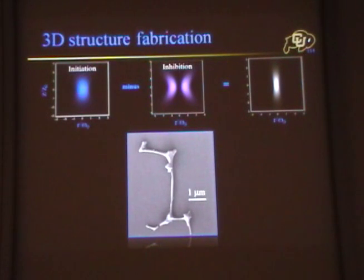So this is some preliminary results, you can tell they're a little preliminary because that's ugly, of doing now full three-dimensional stereolithography, like the two-photon folks do, with this, to prove that this is a transient feature. What we're drawing here is 100 nanometer diameter, 5 micron tall wires. 5 micron seems short to the graduate student until we realize that 5 micron and 100 nanometers is an aspect ratio of 50 to 1. And of course, when you do the solvent wash, you've got this little forest of trees and they all blow down in the solvent wash. So instead, you make these little things that we call our very small rabbit skeleton.